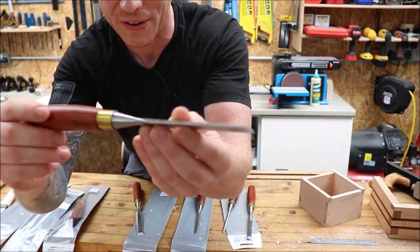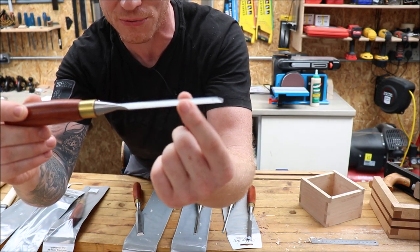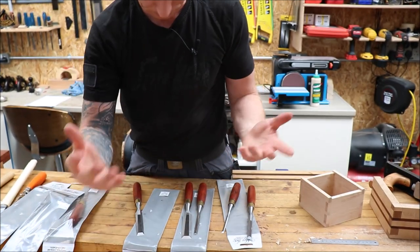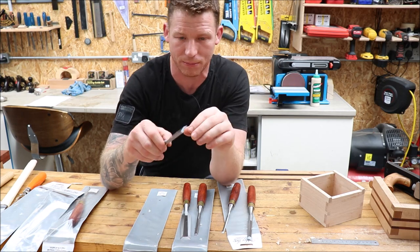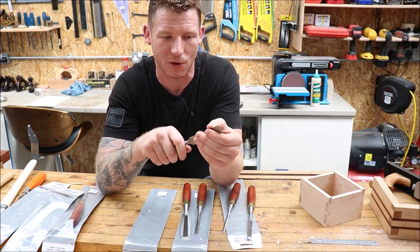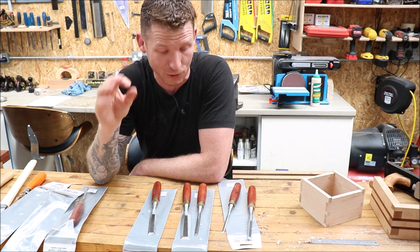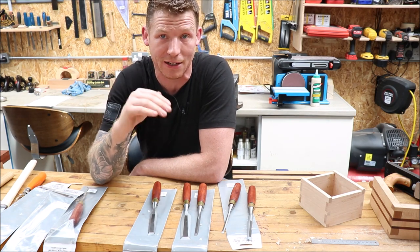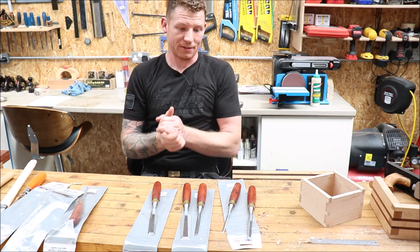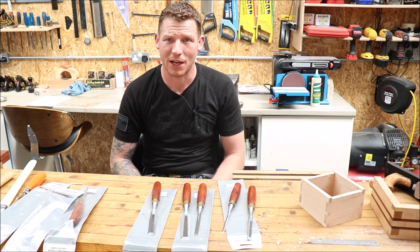They are a bevel edge chisel. You can see just how thick the side is on the Stanley compared to the side of this Ashley Iles one — you can see how fine a point it gets down to. It still has a slight flat side, but nothing like the slab side on the Stanley bevel edge chisel. That grind down to almost a point means you can get into the angles of your dovetails without bruising the corners and clear out the material. Ashley Iles also make a specific dovetail chisel which goes down to an even finer point if you want to get right into those corners, but these have been perfect for the job.